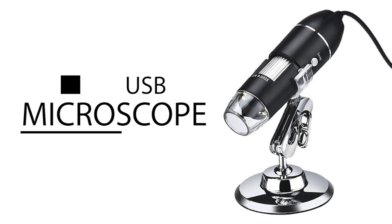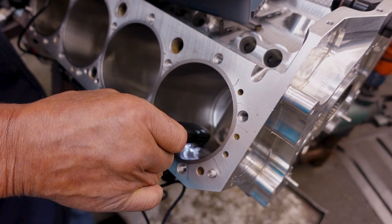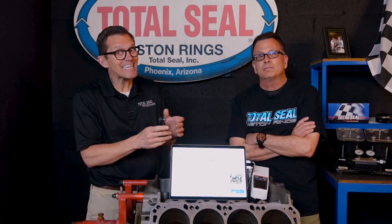The ability to go in there and check your work and see — is that torn and folded, or is it nice and clean cut? Because that's something we've seen many times. You can have fake numbers because you ran the machine with too much load and it streaked and smeared, and it gave you the number, but it really wasn't clean. So it didn't last — it tore the rings up. All those things happened because you couldn't see it.